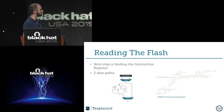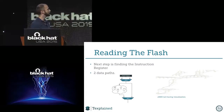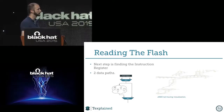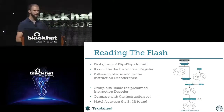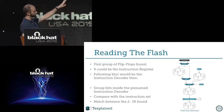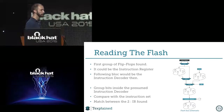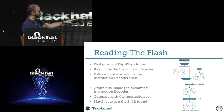So again, to follow this is pretty easy. And you have the example of what the software is giving us as a visualization. The visualization part of the tool is not super fancy yet, but it's far enough to get the information you want. Anyway, after a day of work, we get to this point where we followed the two paths coming to one, then there is another mix. Then there is also combinatorial logic, so it could be also scrambling something like S-boxes. And then we have registers.